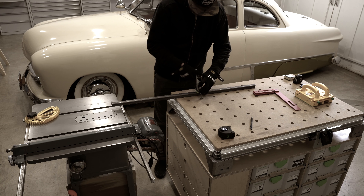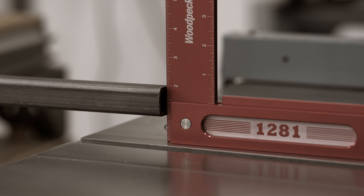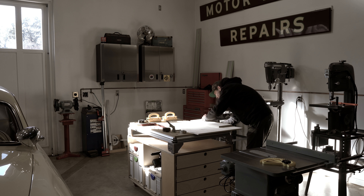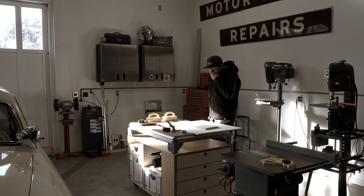The first thing I did was get some scrap steel tubing and clamp it to the surface of my MFT. Then I took a measurement from the top of my table saw to the bottom of the tubing — it ended up being right at around 15 sixteenths of an inch. From there, I hunted around my shop for some materials of the appropriate thickness and found some scrap pieces of half-inch Baltic birch plywood. When stacked, I'm a little short of my goal, but it's a start.